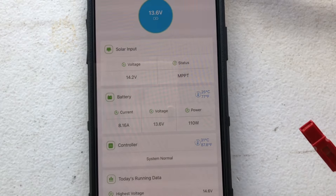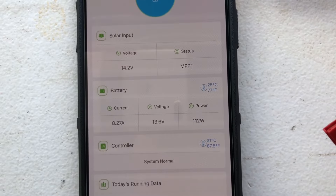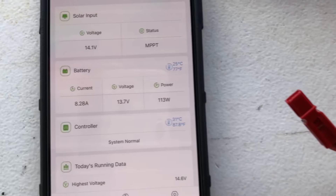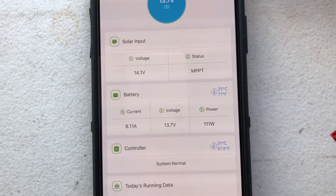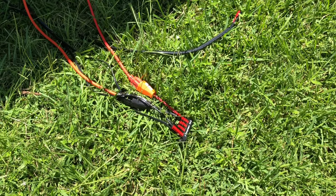Adding all three wires in each of these electrical cables sure helped a lot — we're not really losing much at all. This is a viable solution. Plugged back in directly to the solar panels, we're getting about 8.5 amps. So we might be losing about 2 amps going through that 100 feet of wire. But if this were 50 feet of the same gauge, we'd probably have even better results. I'm going to call this a pretty darn good success.